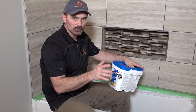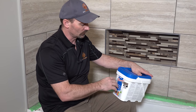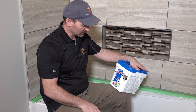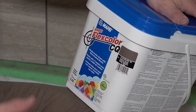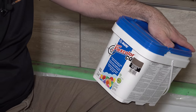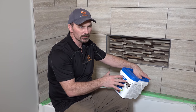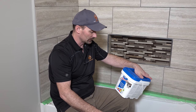Nobody's sponsored us to do this video. If you've watched our channel a lot, we don't generally show name brands or anything like that, but there are times where there are products that I know and really trust. This grout here is something I use all the time — I don't even look at any other kinds. You can buy grout in a bag and mix it with water, but this is already mixed. You don't even have to stir it in the bucket once you open it; it's all ready to go. I've never had any failures with this. It doesn't need to be sealed after. It's stain resistant, mold resistant — it's perfect for showers.